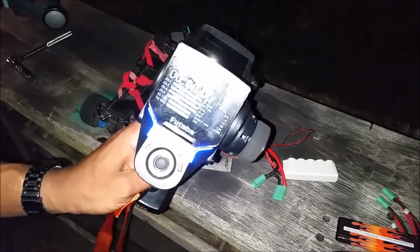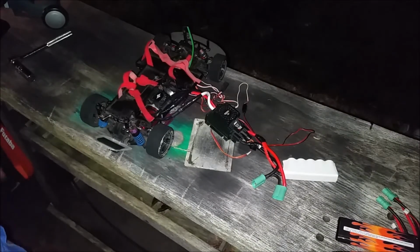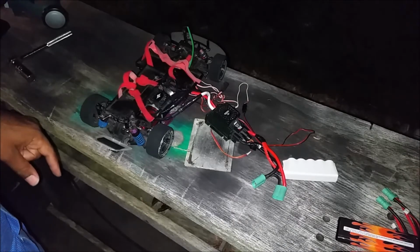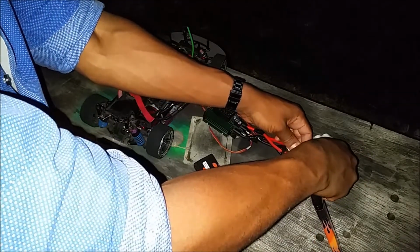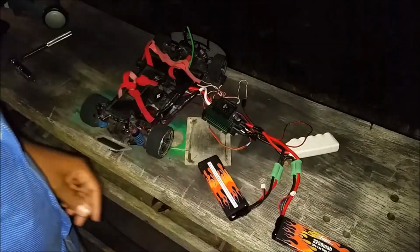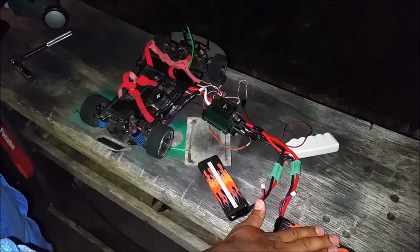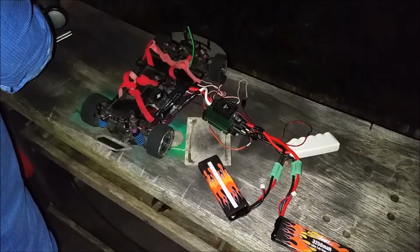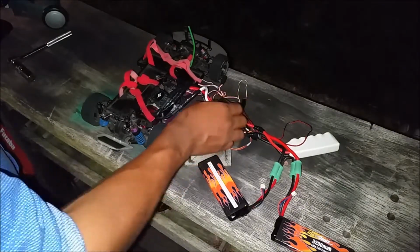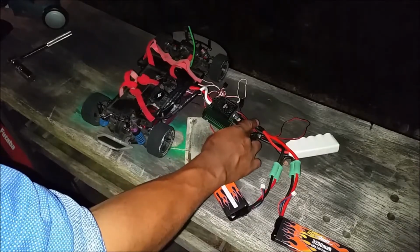Got my radio, my Futaba, set to the proper car. So here we go. Sounds good. I think we're good. Batteries aren't heating up. Cap pack's good. I got steering. Fan on my ESC is working. The ESC is not too hot. Cap packs are not hot.